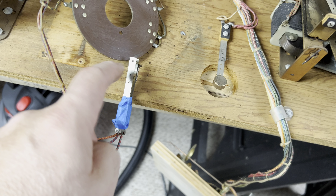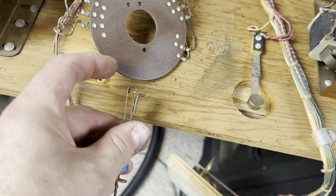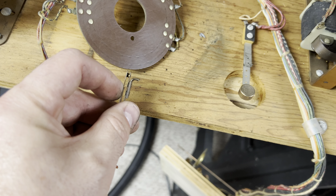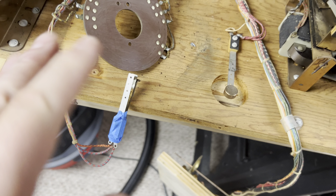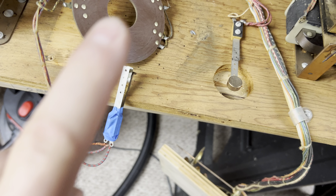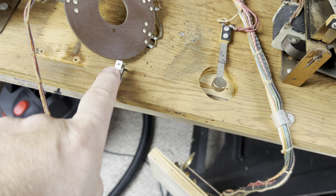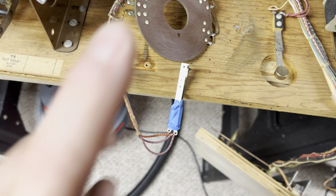That's not good. Even though they go like this and make contact, if each contact is not tight onto the leaf, even if it does touch each other, you may not get a contact — just because it's loose. So I go through and I solder the spinners up so they're not dead and they work.